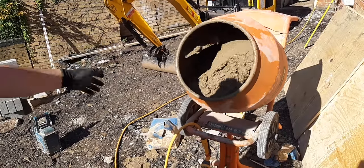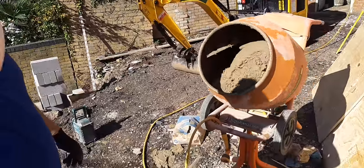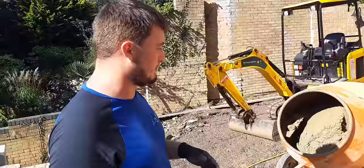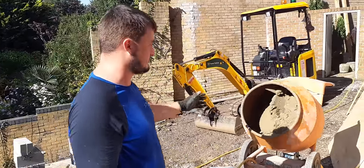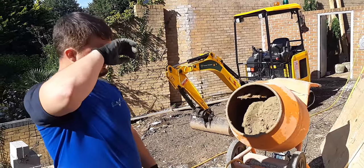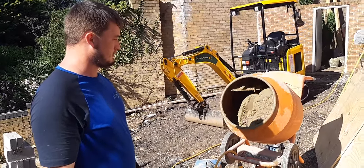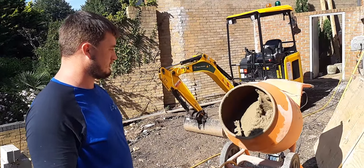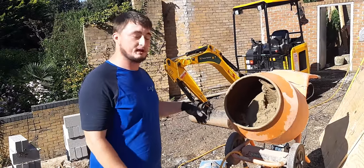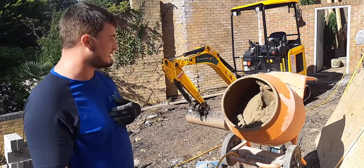It's already starting to get there. I want to let it mix a bit more, because it's still maybe a little bit too dry — not quite there. Just don't add too much water. When I stepped away from the water it still looked really dry, but you've just got to watch the magic and watch it do it. So what would happen if you gave a substandard mix to, say, a plasterer or a bricklayer or a ground worker? Well, I'm going to get it perfect, because when you're laying the blocks it's got to be great — it'll be much easier for you to use and it's just an all-round better job.